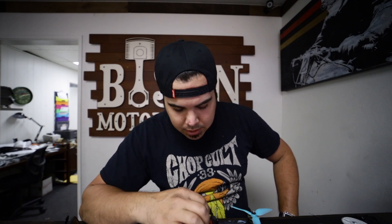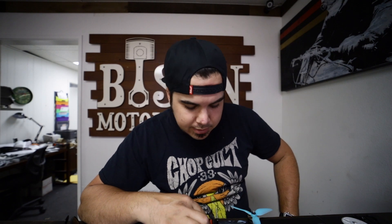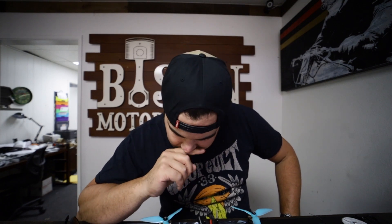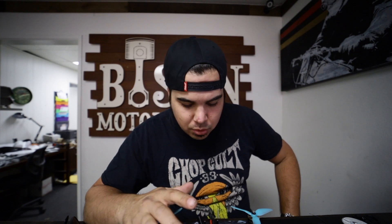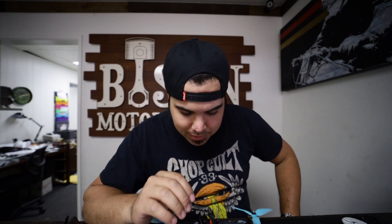If you were with me yesterday, you'd know that in the live video I was doing I had a little bit of a crash that knocked out the electronics in my board. I'll link that video up above. It wouldn't arm or anything - it knocked out the Nano RX on my quad and pretty much the OSD. Something with the components on the board. I'll try to reflow the board - I've been told that works, like some stuff lifts off the pads.